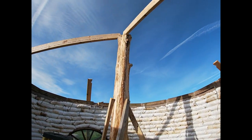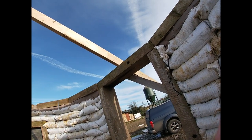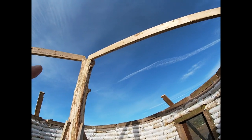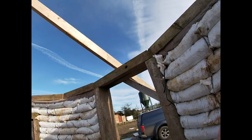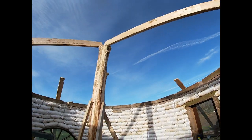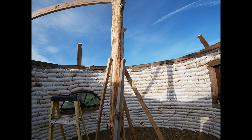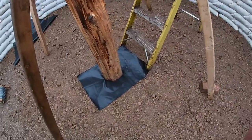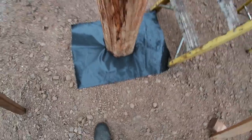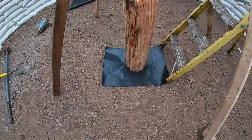As I don't have a ladder tall enough to get up there to attach these to the center post, what I'm going to do is get four of them pushing against the center post from all opposing sides, then lock this far edge into the top beam to provide enough stability that I can lean our longer ladder up against it and get right up there. Also had to take the pole down this morning to get a sheet of plastic underneath — I forgot to put it in — so that way when we cover the whole inside floor in plastic, we've got plastic all the way around the post too, to stop moisture wicking through the floor into the concrete and into the wood.